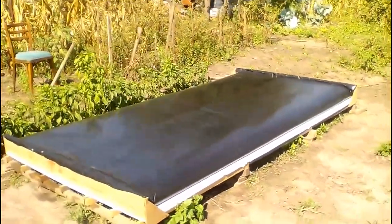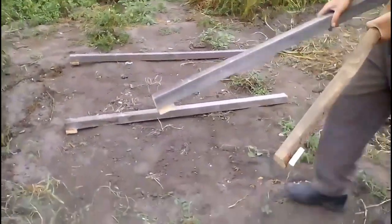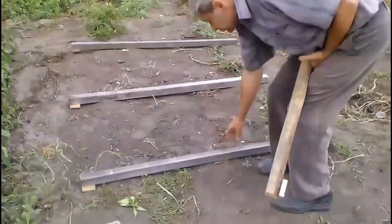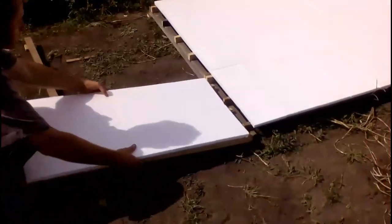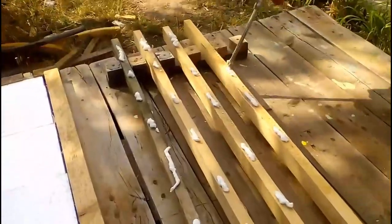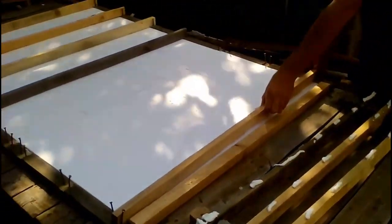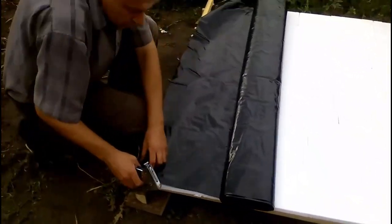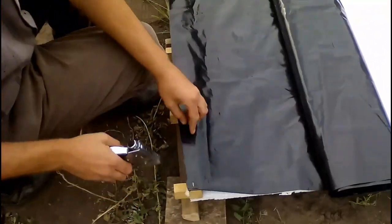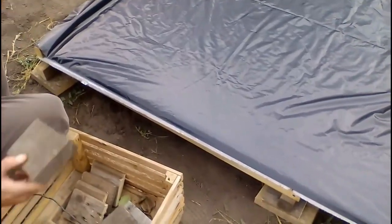This old solar heater was described in two previous videos over a year ago. Construction begins with laying beams, then installing sections fixed to the beams with screws. These sections are made of expanded polystyrene and wooden battens fixed by polyurethane foam. Construction continues with installing wooden walls and placing the black polyethylene sleeve for water, ending with wooden pieces installed under each edge of each beam.